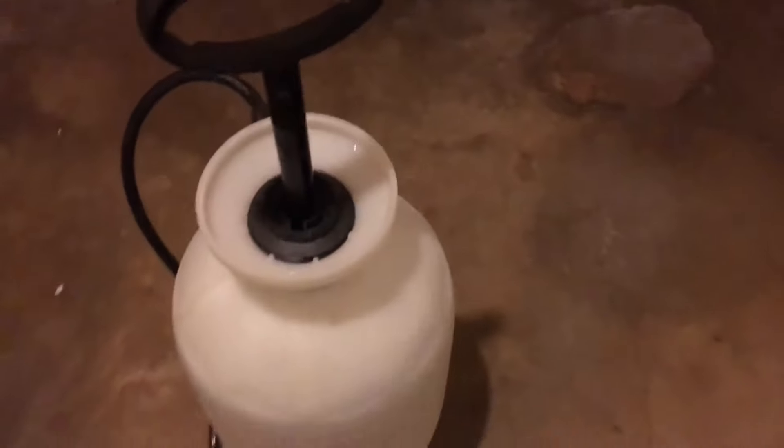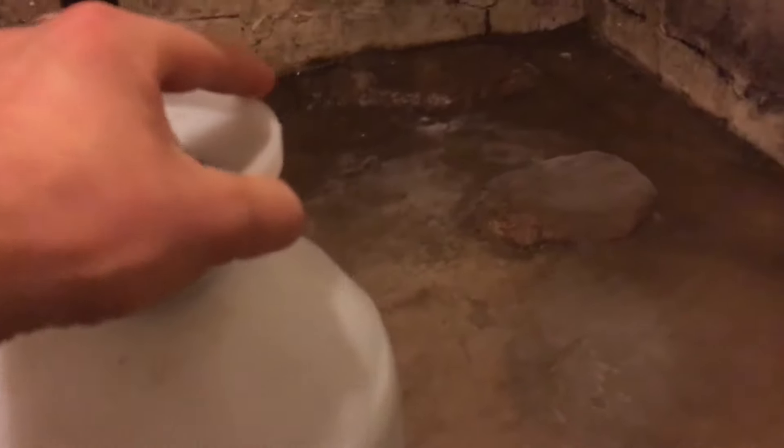For time purposes, and because I didn't want to be down in this nasty area too long, I took a shortcut. I got a sprayer here that I mixed borax and warm water in. The ratio is about one cup of borax per gallon. This is a two-gallon sprayer, so I put two cups of borax in here with warm water, then pump it up.